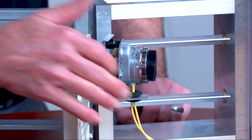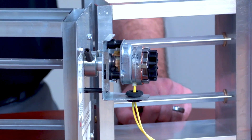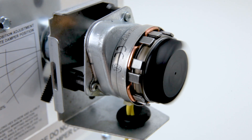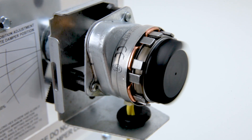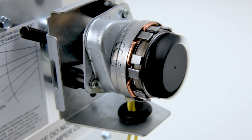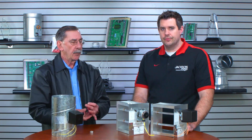Dampers improved. Now we have a spring return actuator that, when it gets to the end of travel and the blade mechanically stops, there's a spring that actually takes up the backlash and absorbs the inertia — so the gearing doesn't slam to a halt and start breaking. The next improvement was an airbrake. Because it's encapsulated in its enclosure, as the spring starts to pull the damper blade open, the airbrake keeps it slowed down, giving a gradual return with very little impact on the gearing. Spring return dampers have really improved.